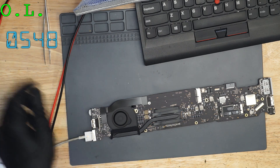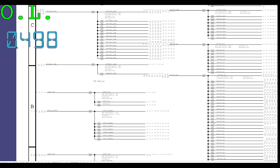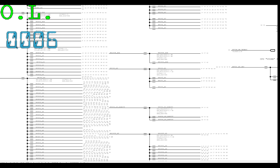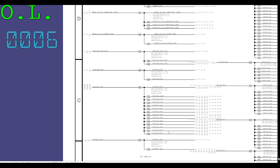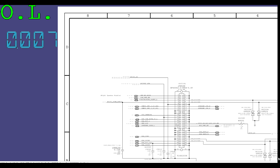As I was saying about the power rails, this is an important thing to know — very important. It's something I go over in my document linked down below. That is a freely available document, about 100 to 150 pages, a guide on Introduction to Board Repair. When you have no power, I like to go to the page on the schematic called Power Aliases. It's going to be called different things for different schematics for different machines, but on the MacBook it's the Power Aliases page. That list gives you all the different power lines required in that machine, and if some of these are missing, it's not going to work right.